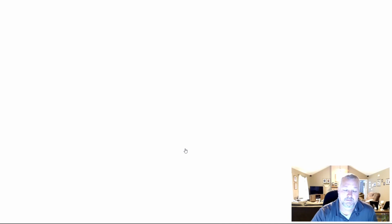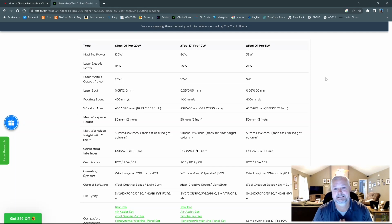As you all know, and if you don't, kerf is the amount of material displaced by a cutting mechanism, whether it be a saw blade or a laser. With saws, if the saw says the kerf is 1/16th or 1/8th of an inch, and most skill saw or table saw blades have around an 1/8th inch kerf, that means all the way through your material the kerf is going to be a consistent 1/8 of an inch, because that blade does not change shape or size. It's a big hunk of steel with sharp edges, and it does not change.